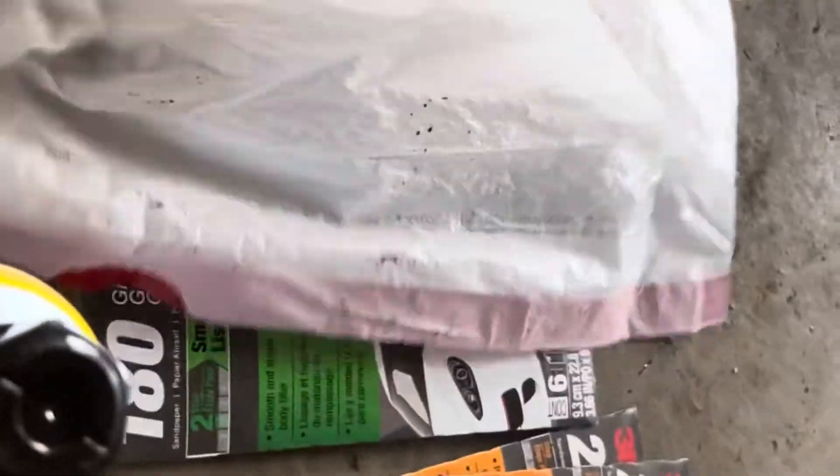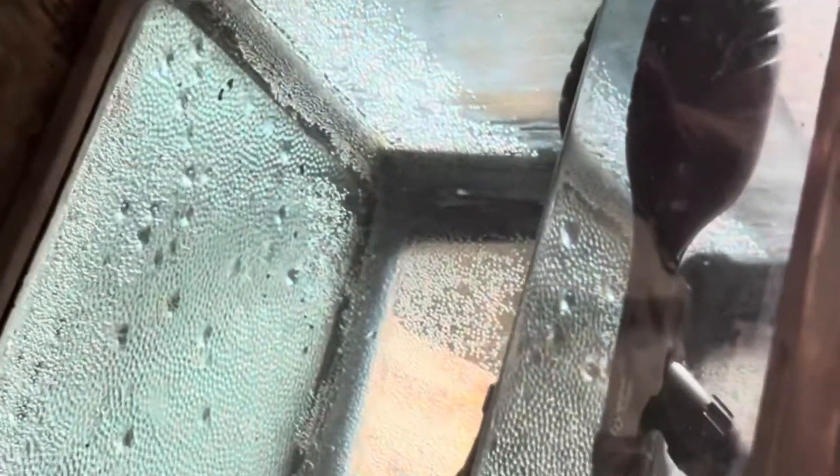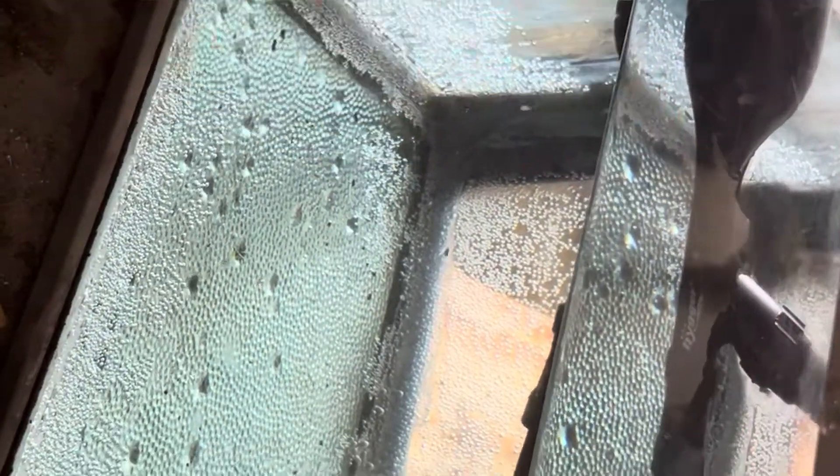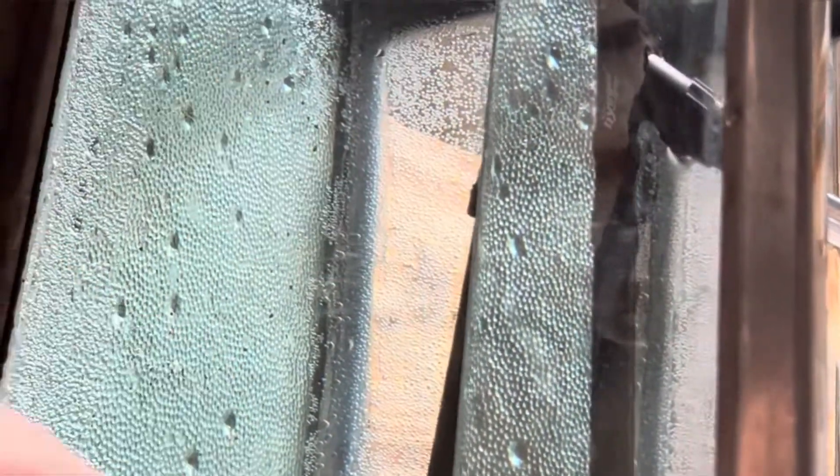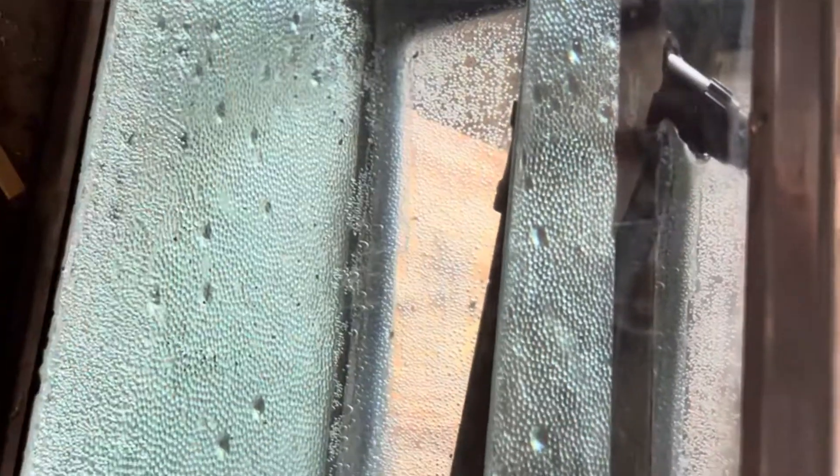Back to the point — trash bag, painters tape. The painters tape I'm literally gonna be putting across the glass at least two to three inches off of each edge where I'm trying to sand. So if I miss and I hit it, I hit the tape, I don't hit the glass, therefore preventing scratches.